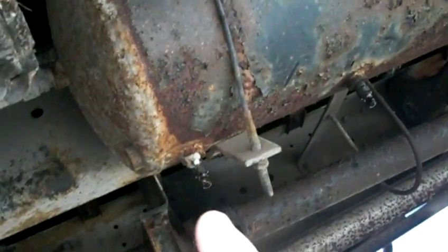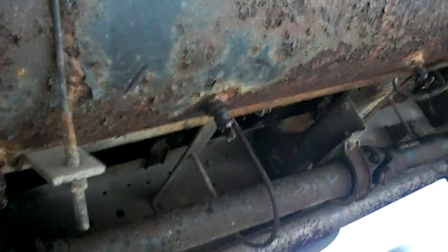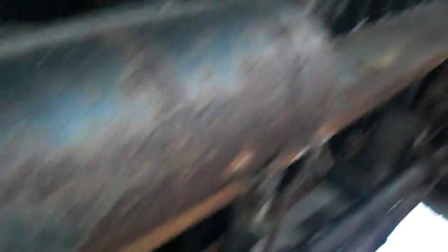Although it's not hissing right now, which it should be — I guess I haven't used the brakes. Here's my air tank — my three-part air tank. As you can see, there are three different sections: here's the wet tank, the primary, and then the secondary is over there. I'll go ahead and leave the draining for now — it's just air draining. But it's got air and I want to go back in and see how much the air has leaked down.